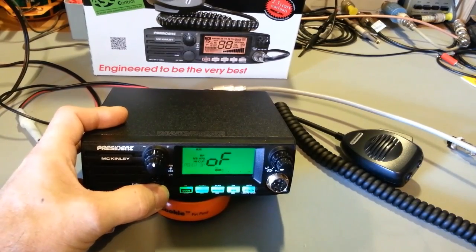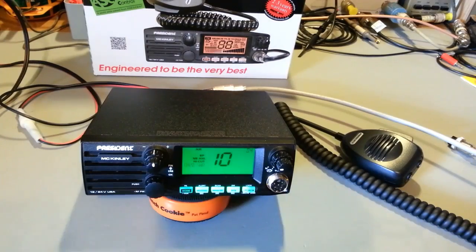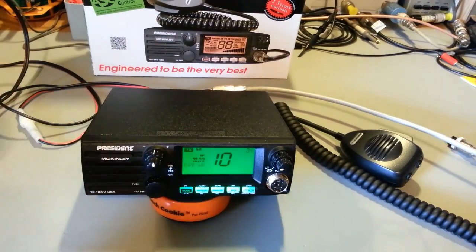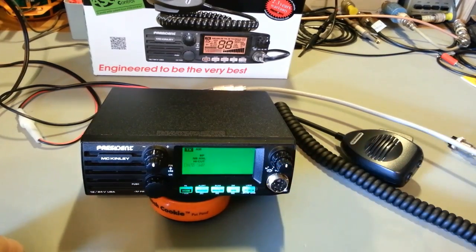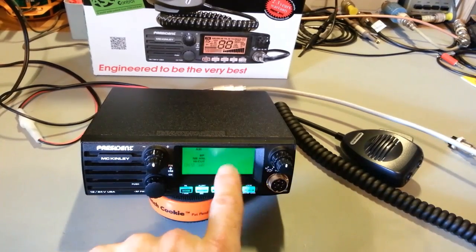So, enough gum flapping, let's go in and take a look. Just go to where it says channel 20 SWR, don't do anything. It'll automatically do it. Matter of fact, you can hear my BK1040 over there. That's the relay clicking every time it goes into transmit. And you can see our SWR is perfect. And if I turn the volume up, you hear a really high-pitched tone. Steady, not beeping. So the SWR is 1.0.